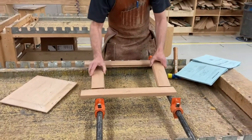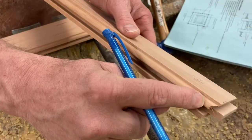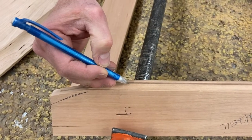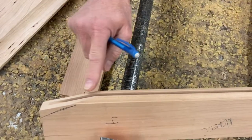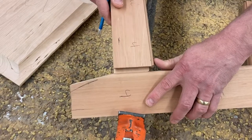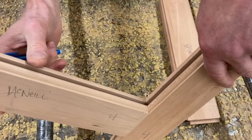So let's do a dry fit. A word of warning before you glue this together: check and make sure all of your joinery is accurate and thoroughly cut. These all look like they are, but sometimes there's a flat spot where the shaper didn't get it quite cut and it doesn't round all the way over. If that's the case with your piece, go over and reshape it so that it does roll all the way around. This joint and this joint fit together like hand in glove, and if you have any flat spots or incorrectly cut joinery, it won't go together well.